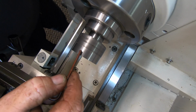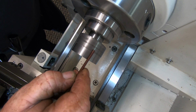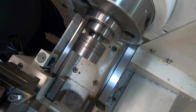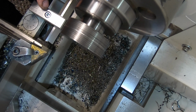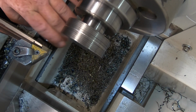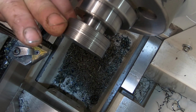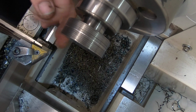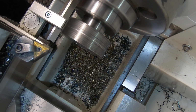What I'll do now is turn all the excess off the front here, and then I've got to turn 8 millimeters off this thread. So I won't bore you with all that, I don't think. I've set up a hard stop down here. So I've got it roughly 170 odd thou to come off this to bring it down to 40 mil. There we go, metric imperial again. So 85 thou roughly on the dial.